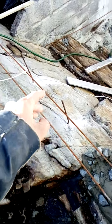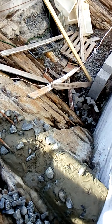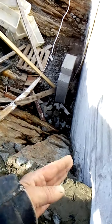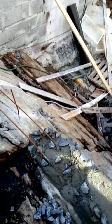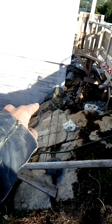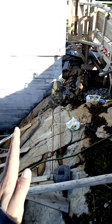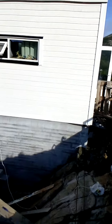These rebars are attached here to help hold things together and handle the inclination — it's very steep. My legs have been shaking after standing here balancing, pressing my legs against walls or cavities to keep myself steady. I'll make a pillar here by putting rebars straight up. The rest won't have vertical rebars, but the pillar will have one because I don't know if I'll eventually be making an extra floor or building on top.